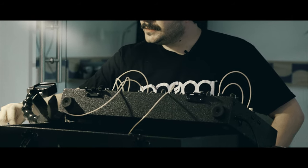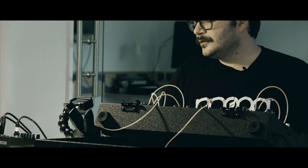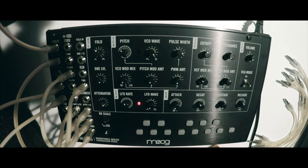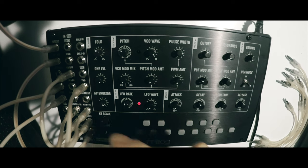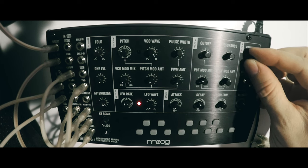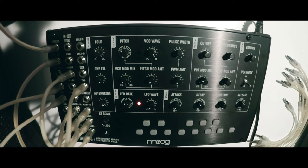In addition, we have an updated keyboard that matches the Mother 32. It features a scale control where, fully counterclockwise, we have traditional volt per octave scaling, but that scaling can be increased to explore non-traditional scales on the keyboard. It can also be used to transpose sequences coming in. There's also a glide control to make pitch changes immediate or allow you to slide to the note.